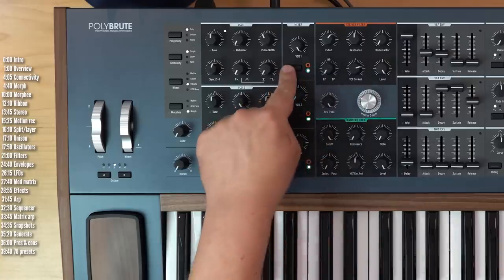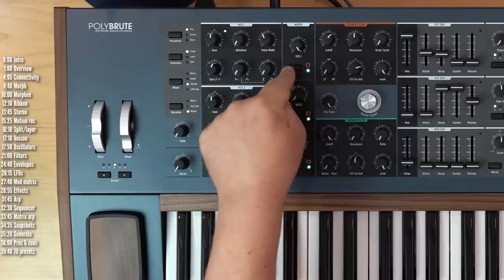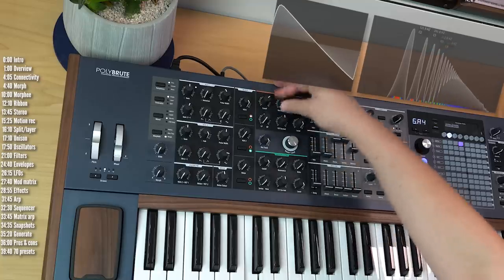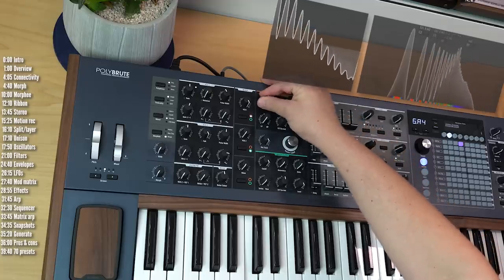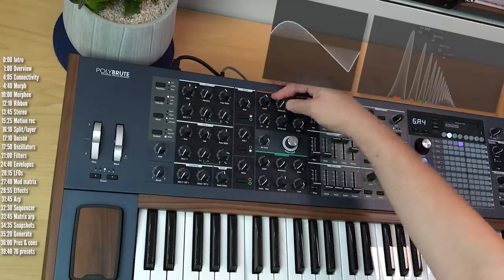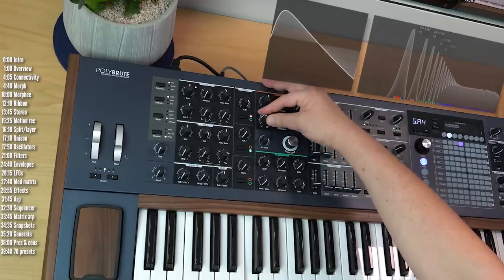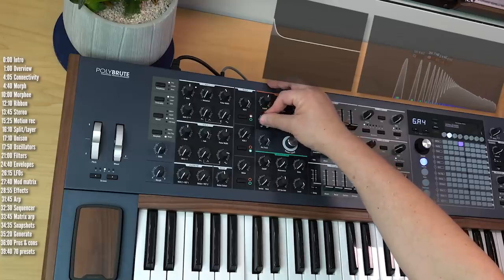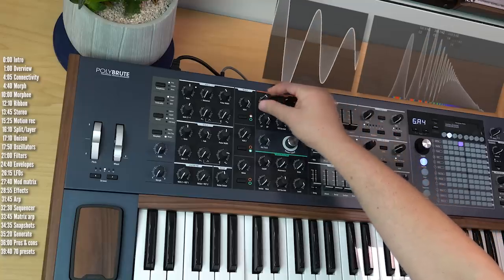Like I mentioned earlier in the mixer, you could route the VCOs either to both filters, none of them, the Steiner filter, or just the ladder filter. Let's check out the Steiner filter. So, it has its own character of resonance and a 12 dB per octave slope. And it morphs from a low-pass mode to notch mode, in the middle between low pass and high pass, to high pass, and there's a nice detent here. Then it goes into band pass mode with resonance.